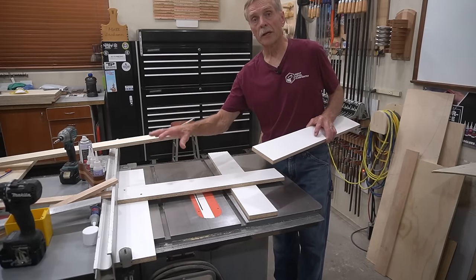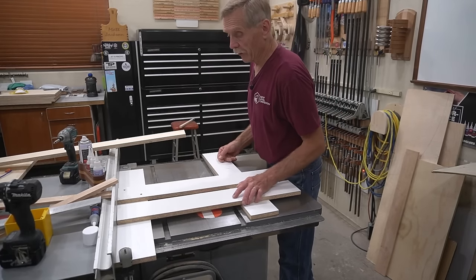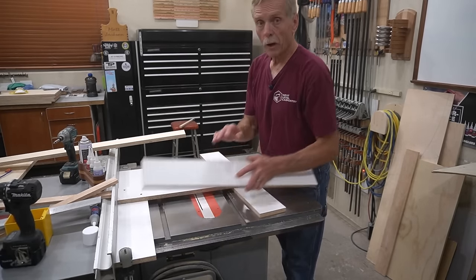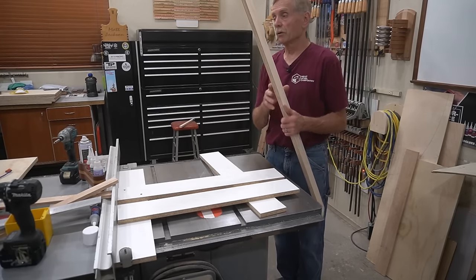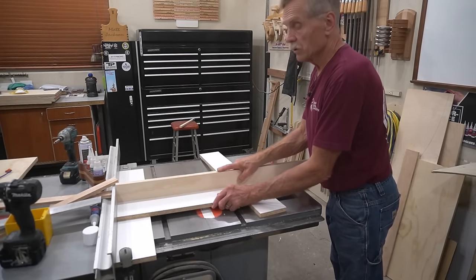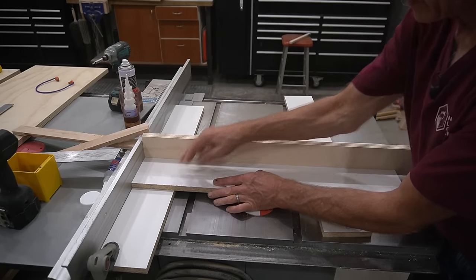With those first two pieces firmly attached, I add a second piece. I've added a clamp to hold things in place while I work alone with the camera running. This second piece is the same width and thickness as the first, with a very clean straight accurate edge. The key thing here is to use a piece of scrap material from the actual shelves you're cutting dados for — an off-cut from one of the side pieces — so it's the exact thickness you want, and you can just drop it down in between the two pieces.